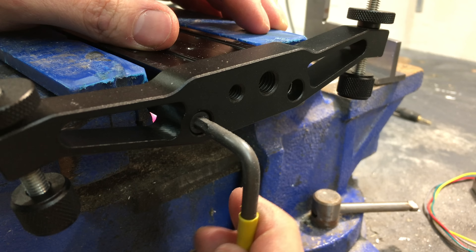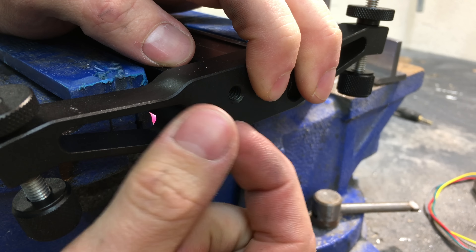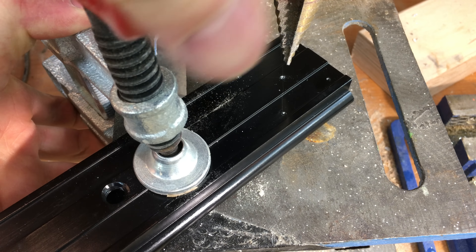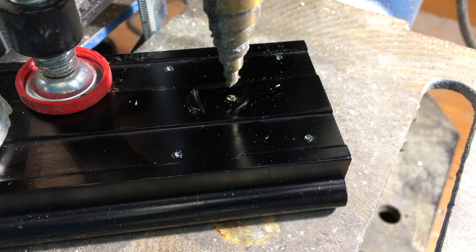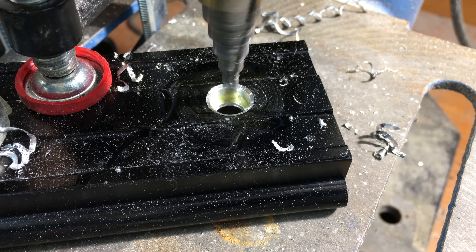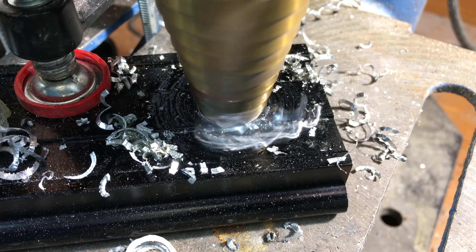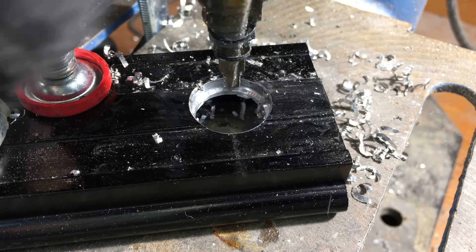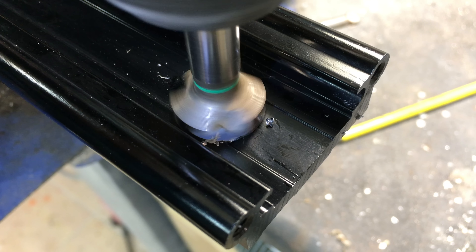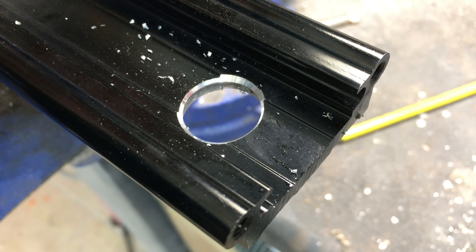The carriage of the slider had a really low profile, so I had to drill large holes to lower the pulleys into the track. This is best done with a step drill bit. They are fairly cheap and they can drill a variety of diameters. You could also use a hole saw, but then you would need one hole saw for each diameter. Whatever you use, you should always use a lot of oil.